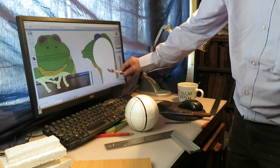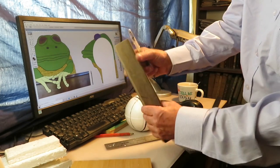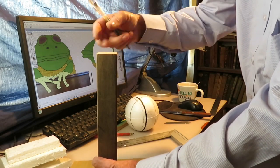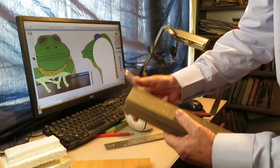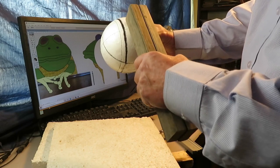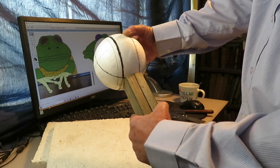This block at the bottom of the head is a square block, and it has to be inserted on a column which will be attached to a base firmly on the table, so it's easier to work on the clay figure — whether I have it standing up or on its side while I sculpt and turn it around. We have to create this block around the wood, the wood has to penetrate to about that height, and around the wood we place foam to cover all the surface so this side is completely straight.